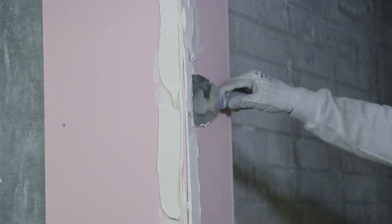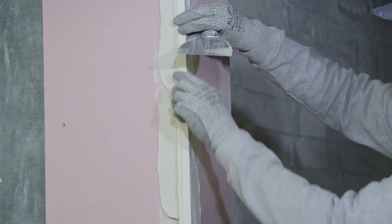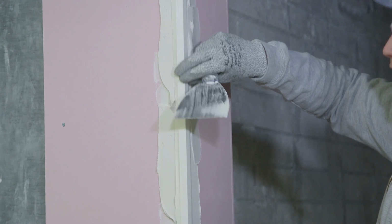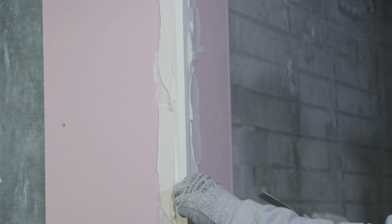It is important to note that in order to achieve the fire resistance with GypLyner Encase, all external joints and flat joints must be finished with either gyproc joint materials as demonstrated here, or thistle finish plasters.